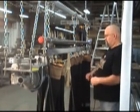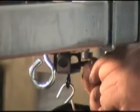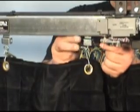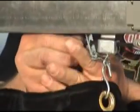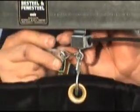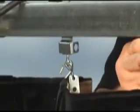Place the cable coil on the floor beneath the master carrier with the knockoff ramp. Locate the C-98 cable clamp that came with the master carriers. Tape one of the cut ends of the cable and thread it through the C-98 clamp and then through the dead end pulley side of the master carrier. Continue threading the cable through the first single carrier as shown. This track system is utilizing backpack guides, which are optional. These devices are used when it is desired to have the curtain go into the stack as a flat sheet, as opposed to stacking as it moves back into the stack area. If your system is employing backpack guides, thread the cable through these as shown, as well as through the single carriers.